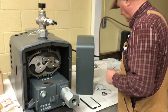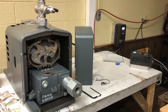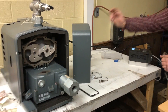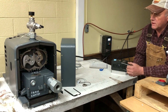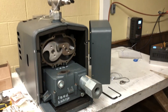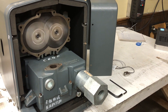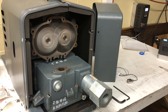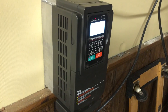Let's fire it up. I want to let it turn slow so you can see it. There are such close tolerances that the air is compressed and pumped out the exhaust. This is just one hertz — it's barely moving. You can run it all the way up; actually, you can run this one above 60 hertz. They're telling us you can run them up to about 70 hertz on this pump. So you could go from 48 to 60 CFM by going up in hertz, and that's all done through this Westinghouse drive.